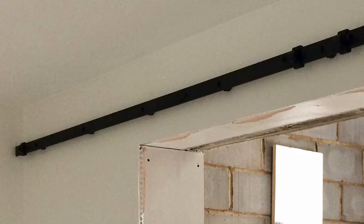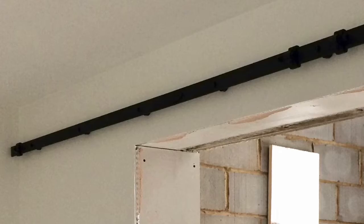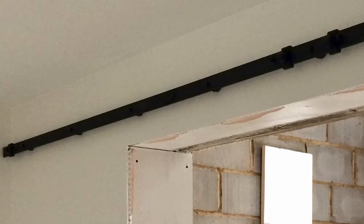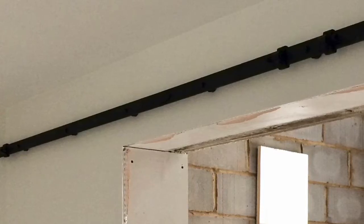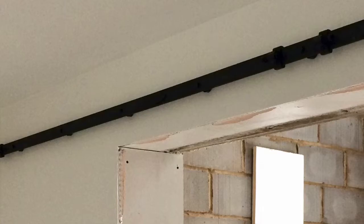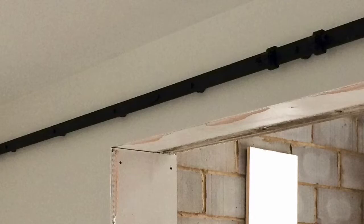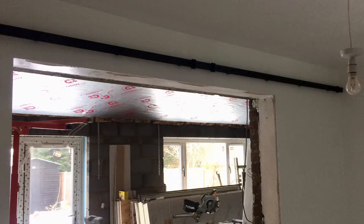I had thought I was going to make some sliding barn doors, and then needed to find the rail. Buying complete ready-finished doors was going to cost an absolute fortune. After much debate, I ended up buying the rails shown in the photo from a site on Amazon. I was a bit reluctant as they were coming from China, but they looked good and were nice and strong when they arrived. The key thing to remember is that you need a rail that is twice the distance of your opening — so for a 1.8 meter opening I needed a rail at least 3.6 meters long.